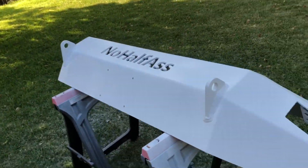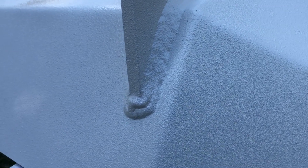The bed liner is all on there and done. I would definitely recommend getting two cans, especially for something this size. I was only able to put about one full coat on the bumper, then go back and touch up spots where you could still see bare metal. Luckily since the bumper was already white, that helped a lot — if it had been bare metal, one can would not have been enough. You can definitely see it's got that textured bed liner look — not bad for a spray can.